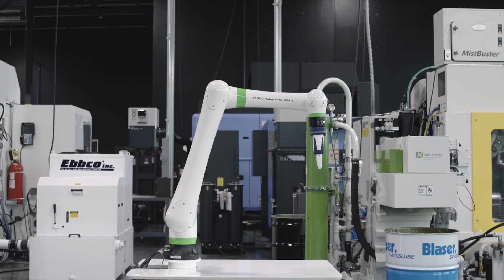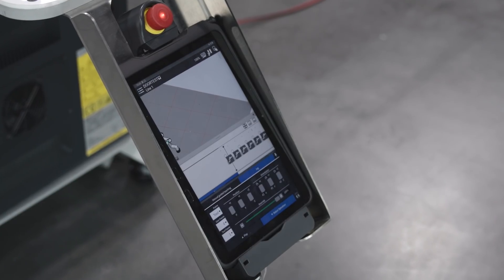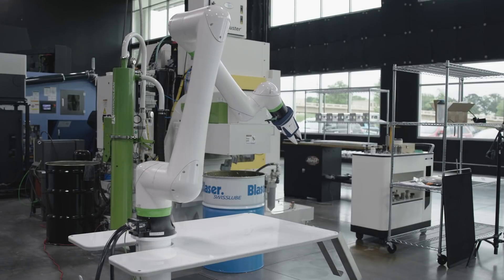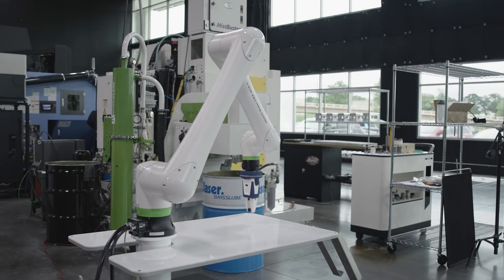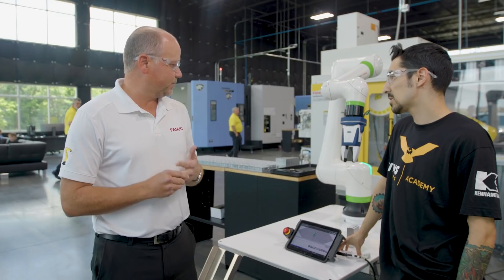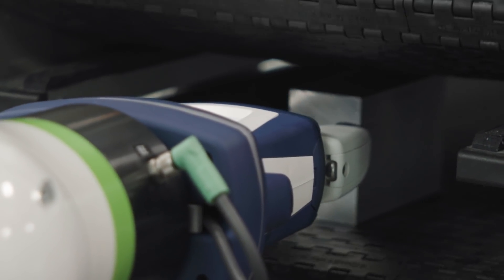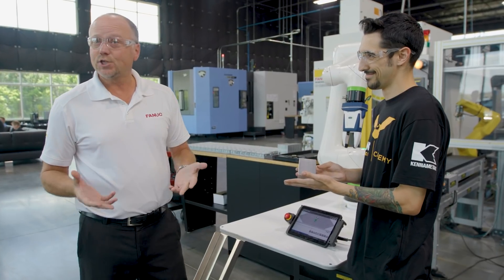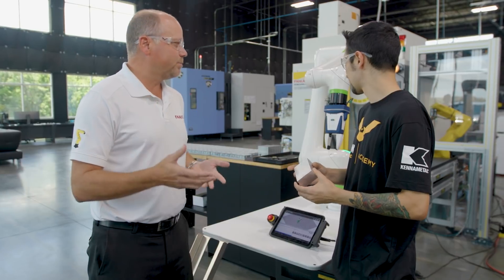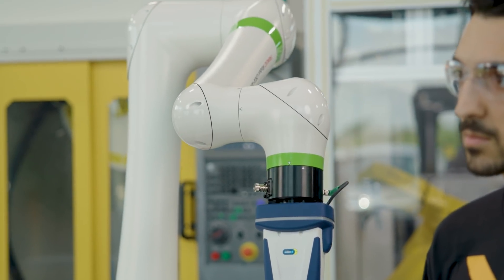I am Matt Gressens, I'm with FANUC Robotics. Right now we have the FANUC CRX-10iA/L. This is a collaborative robot, which means you don't need any fencing around it or any safety features, because if it runs into you it's not going to hurt you — it's just going to stop. Today we're trying to figure out the best way to present raw parts to the conveyor belt to go into the RoboDrill machine. This robot has a 10 kg payload and also has a 1.4 meter reach, so it's plenty of reach and plenty of payload for this application.